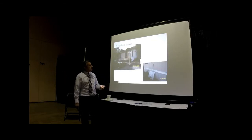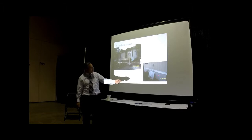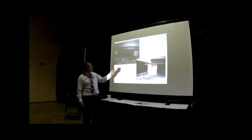Let's go for the easy method. Here's another house, beautiful, by the way. I was inside this house. The young lady inside made that house absolutely beautiful. But the house has a skirting, vinyl skirting, and the very important thing I would like to say is if you have a skirting, you still have to have the masonry stack at the perimeter.